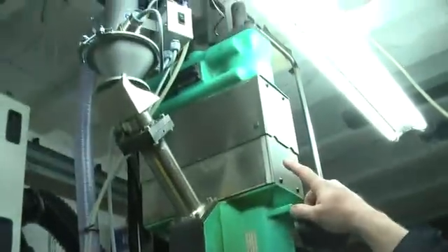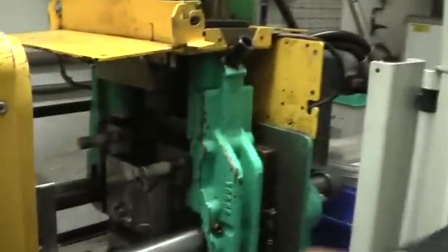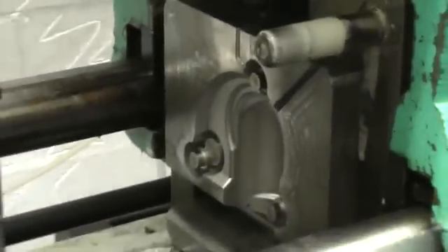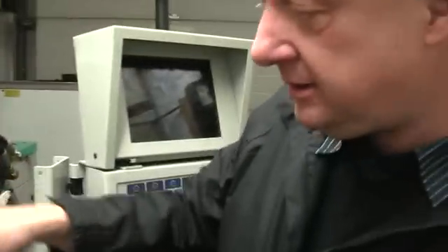This will go into — basically it's fed into the top of the machine, it's melted, and then it's pushed down into the tool itself, which is the tool relevant to that particular engine cover. This particular cover we have here is for the Ducati — it's a water pump cover on the 1198s and 1199s. And you have the cavity here on one side, and the core on the other side. What will happen is that these two parts are pushed together, the material is then injected in, it forms the part, and then separates, and you end up with the finished product.